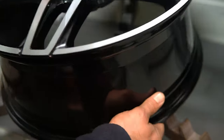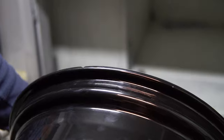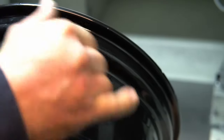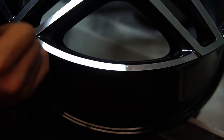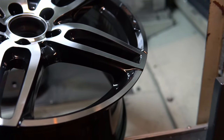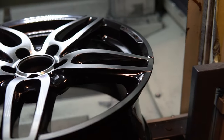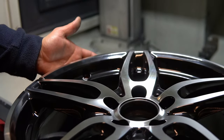Let's check the back — I especially left the marks of the weld on the back, just for you to know where the damage was. The marks are here. I didn't sand them down, just specially for that. And there we go — that's the damage, that's the area which was previously damaged. The most important thing to pay attention to is the lines — the lines are really straight. There are no signs of bubbling from the welding either, which means the weld is 100%. Next step is just the lacquer — the wheel goes back into the oven for the acrylic lacquer, and off we go.